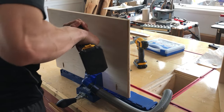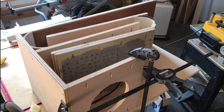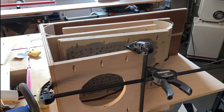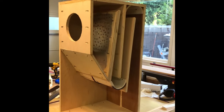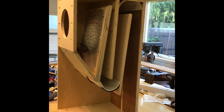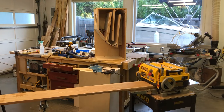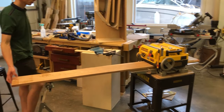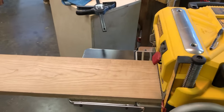Pocket holes helped speed up the project. We made these speakers slightly smaller than the average folded horn speaker, otherwise it would be really obscenely large, but we still managed to get some really good sound at the end. At this stage we were very thrilled to see almost a speaker being born — that's always so exciting. We picked up some nice cherry wood from the nearby lumber store and that made a huge difference in the aesthetics. The back wall where the speaker sits is very well braced, has a double layer, and has multiple perforations and acoustics to provide absorption and dispersion.